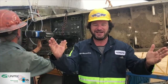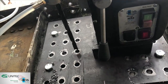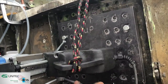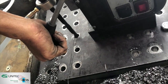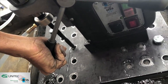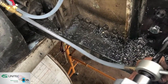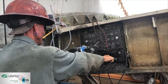Let's fire it up and show everybody what it's like to drill through titanium. You can see the excellent water feeding down through the quill, down through the drill body. This is going through our guide plate and aluminum — it's been pre-drilled so this goes pretty fast — and then about an inch and a half in we hit the titanium. You can see the titanium chips starting to come out. I'm at about 90% of the magnet base holding power right now.